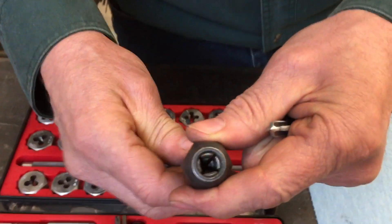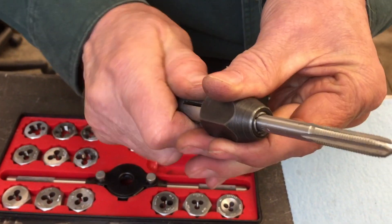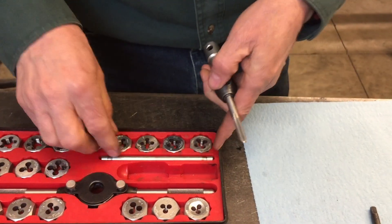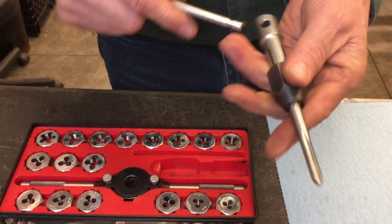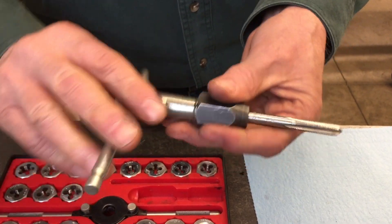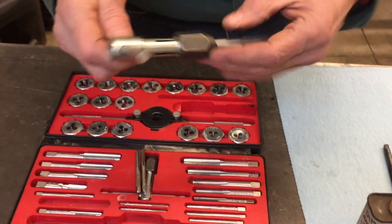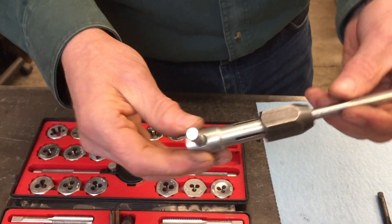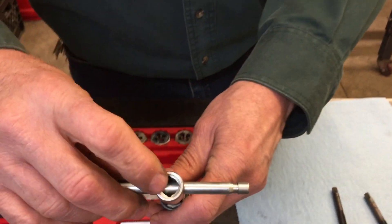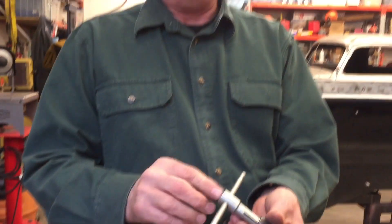Another way is this guy here. You can see inside it's just got four sides and the collet — as it tightens up — it holds the tap. And then there's a little handle here that fits inside and you can spin this in. What's nice about this tap handle is if you're doing something where you can't get a spin going, this fits a 3/8 socket, so you can actually use a ratchet, and that's pretty handy. I've used a ratchet before quite a few times and it's worked really well.